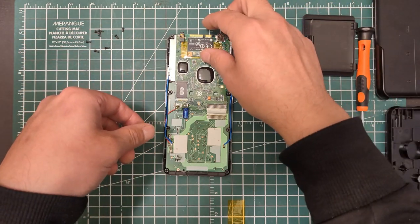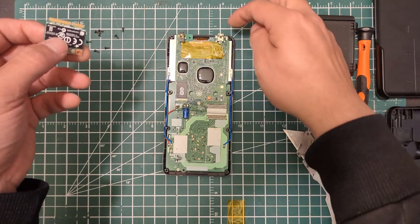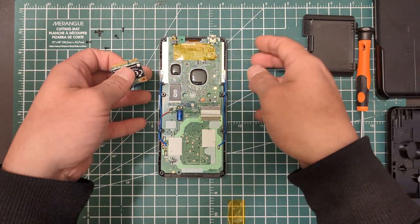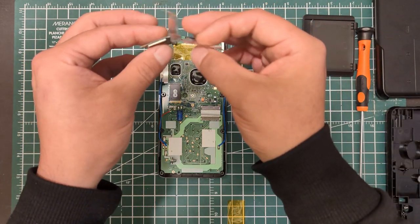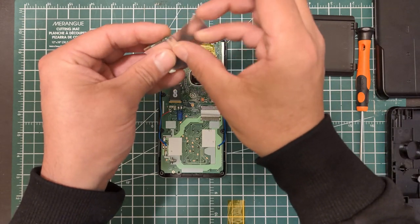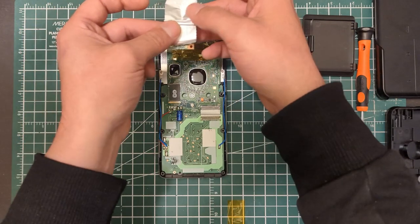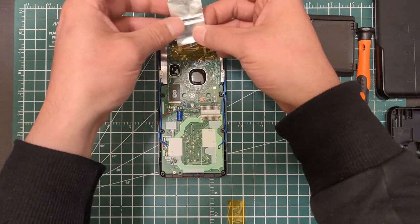The other thing you've got to look out for is: normally you'd have a metal case with an antenna, like on your phone, and that allows it to get a better signal. This obviously has a plastic case, so you can do a couple of things. Probably the easiest is if you get a piece of foil and wrap these pins like this, and then when you place it in, get the foil to crimp into where the case comes together. Then you can trim it down after — you probably want to trim it, so it's really hard to see.